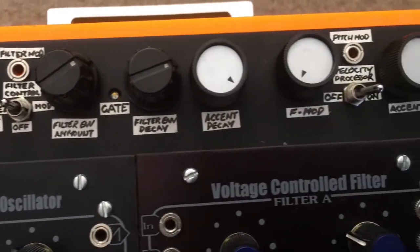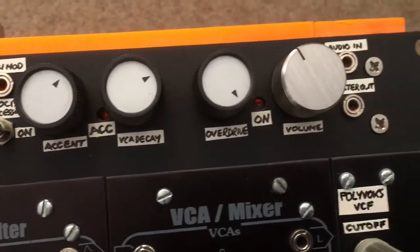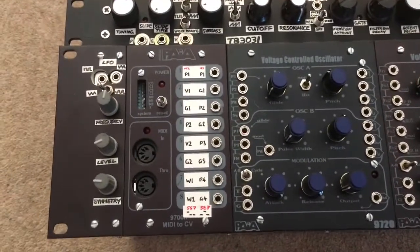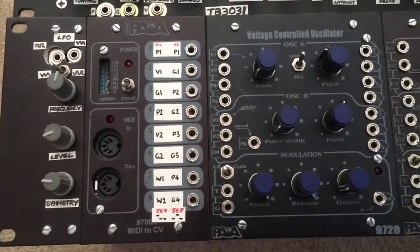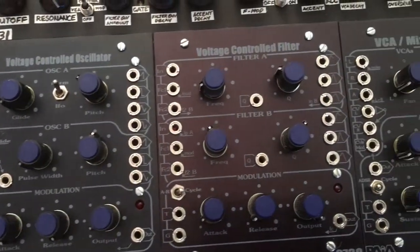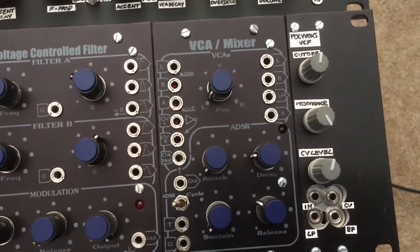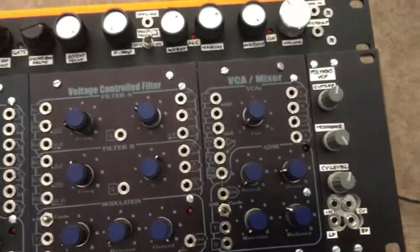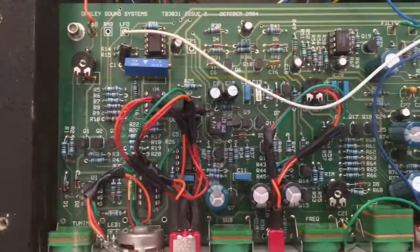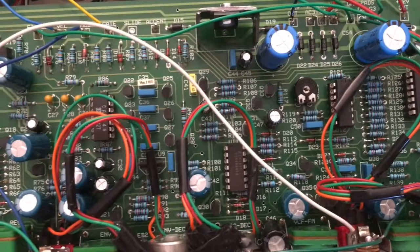I studied the best synth designs and came up with my dream machine, which I built from commercially available and homemade printed circuit boards, which I populated and soldered up with components and then interfaced with the potentiometers and sockets. As you'll see shortly, you configure the sounds using patch cables, wiring up the signal chain yourself, which is fun for experimenting, but of course not hugely practical on stage. The key thing is that all the sound comes from the curious oscillations of voltages in transistors and op-amps, which are charging and discharging via capacitors, resistors and diodes.